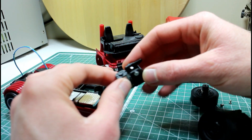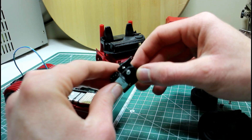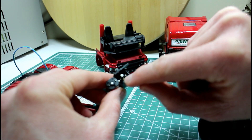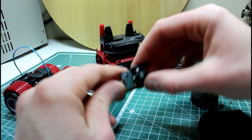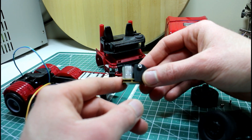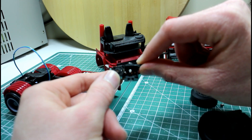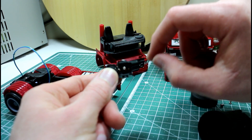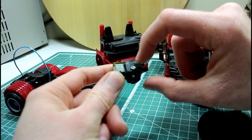We have another N20 motor here, just in a little case. It has two little screws — I think they're M1.5 screws — and they go into the brass casing of the N20 motor. All N20 motors have those two screws either side of the output shaft. Our little piece is fixed there, we have a little arm for the steering mechanism, and we have two lock nuts top and bottom that are going to provide our hinging position for the wheel.